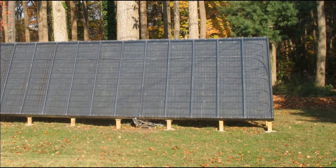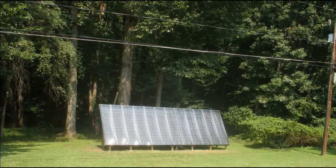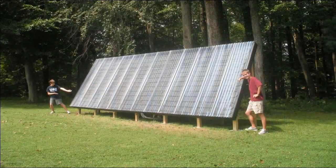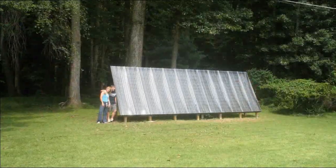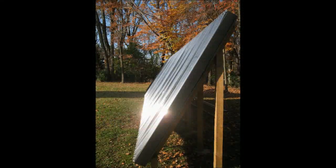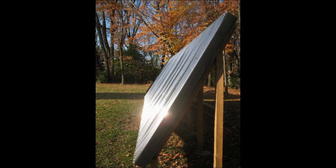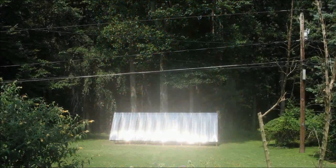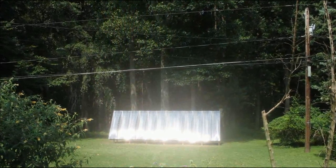I'm really excited about this project. I'm getting about a 30-degree Fahrenheit rise at a gallon per minute from the collector, and it warms my 200-gallon thermal storage tank from about 85 degrees to 120 degrees Fahrenheit in about four hours. The tank typically gets to between 120 to 130 Fahrenheit each sunny day, and that's a lot of free heat. I'm also completely satisfied with the frame, its sturdiness, placement in the yard, and overall appearance. And what's also neat is I can easily retrofit the frame to any internal heat-gathering design I like.